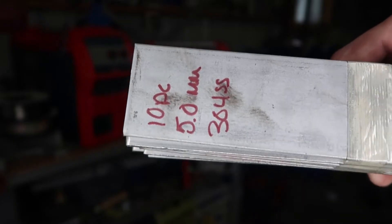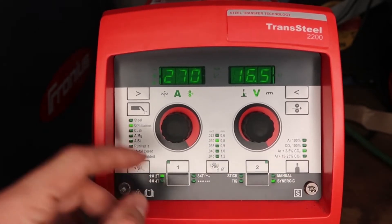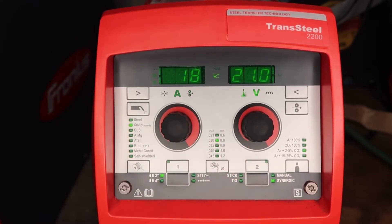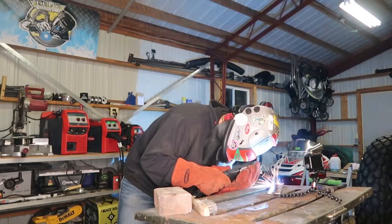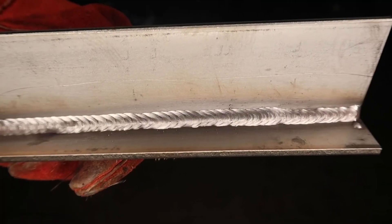Now running the same settings but on 190-thou material thickness on 110V power. I turned the wire feed speed up to nearly max — 380 inches per minute — and increased voltage to 21 volts to ensure the toes wet out on the plate. It's another horizontal fillet weld; I'm doing a back-and-forward motion to create a dime stack for cosmetic appearance. It's a little unstable because I'm between short-circuit and spray transfer on 110V, but the weld seam is very consistent with very little spatter.